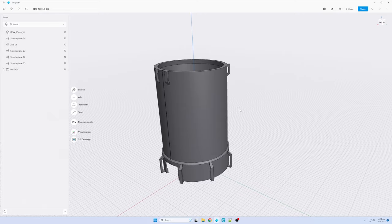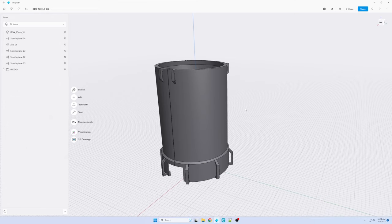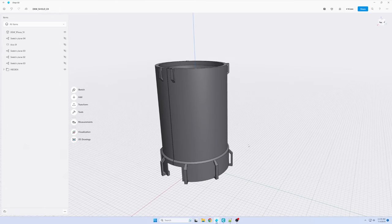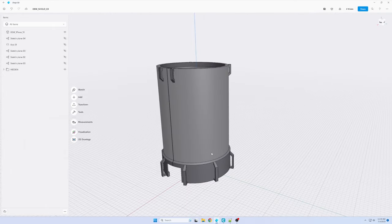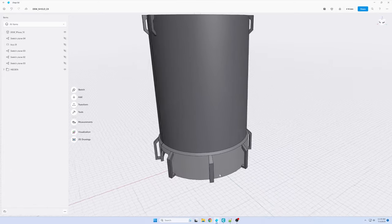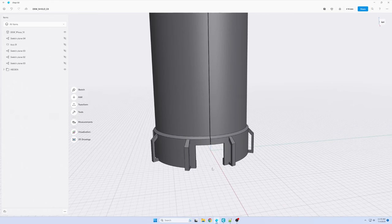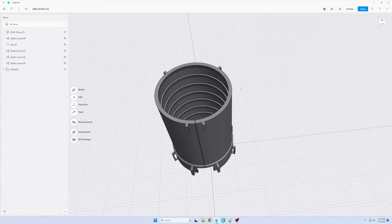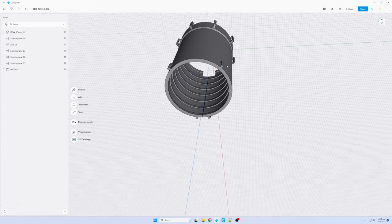Let's jump into my computer and have a look. Here we are in the 3D modeling software I use, which is Shapr3D. This is my custom rigid C8 dew shield. I designed this as a single piece with a grooved opening on one side that allows me to flex it open enough to fit on the front of my SCT, yet still close back together and block any light from entering. I also built in larger strap holders at the bottom to fit a velcro strap as well as two long dew straps, and at the top, a smaller set of holders for another velcro strap and room to tie in my motorized flat panel.